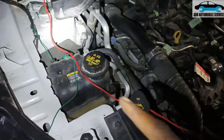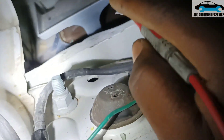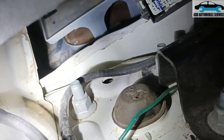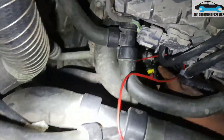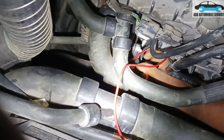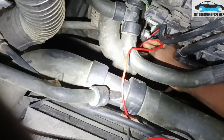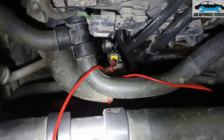You can see the pin — from that side to this side it's beeping, and everything is okay. Now let me go to pin 26. Pin 26 will be on this pin — 49, 58, 59. On pin 59 we'll do another continuity test. I'll swap the pin to the middle pin and you can see the meter is beeping, which is telling me that I'm having continuity.